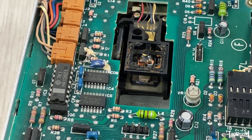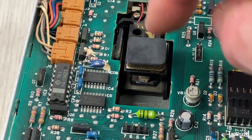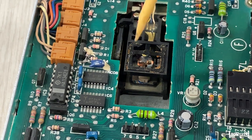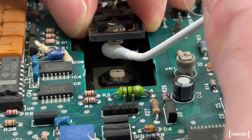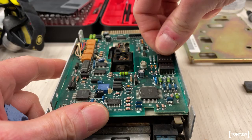This is the main PCB of the floppy drive, and I can see where the fallen pad is coming from. I wonder whether the metal of the pad has something to do with shielding, as the electrical signals of a floppy head are very low and that cover might be required. Anyways, from here I can access the heads, so I can give them a clean, and I think I will reseat all the connectors and use some dry contact cleaner as well.